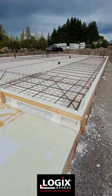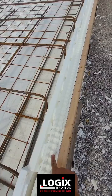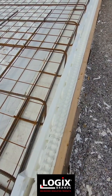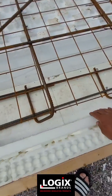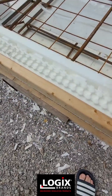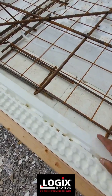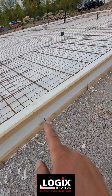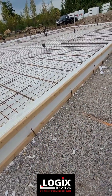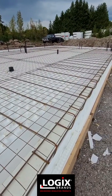You can see our walls. We have our outside form of a Logix knockdown form — 2 inch DRV panel by Logix — which slips in right over the webs. And then we are actually going to be adding 4 inches of EPS to the outside of the wall assembly when we're all done. So she'll be buttoned up tight and warm.